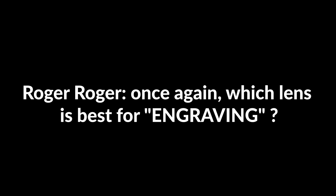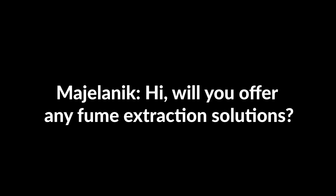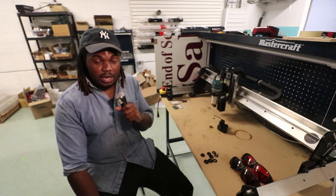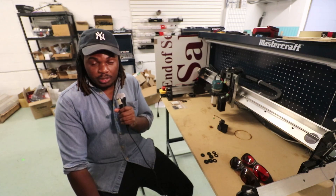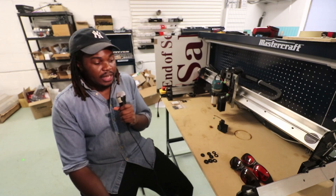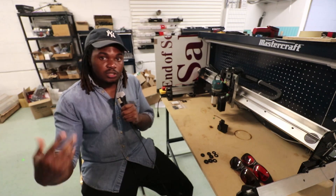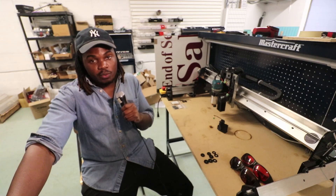Roger Roger asks which lens is best for engraving — the three-element lens. Modulonic asks about fume extraction solutions. As of right now we're not offering fume extraction systems; we let that be chosen by you, the customer — similar to how you'd choose a shop vac for your dust shoe. In the future if demand is there, we can develop a simple system. For now, I'd recommend a 4-to-8-inch inline fan ducting to the outside — a window, garage door, or regular door — to get that smoke out of your workshop.